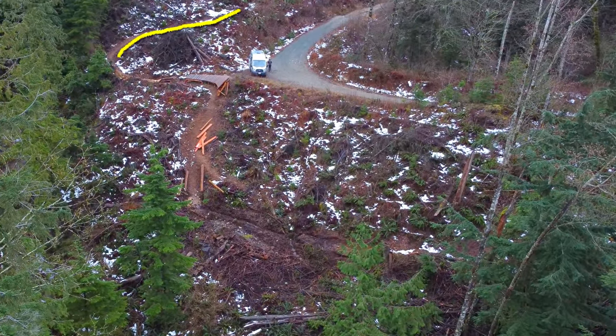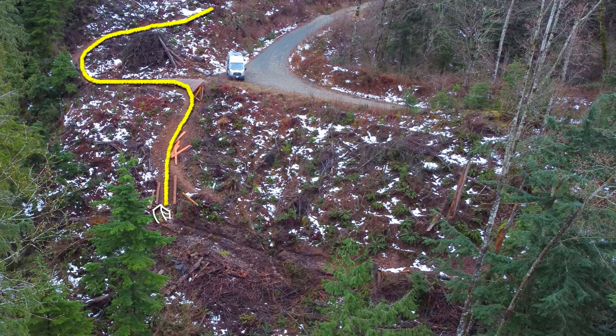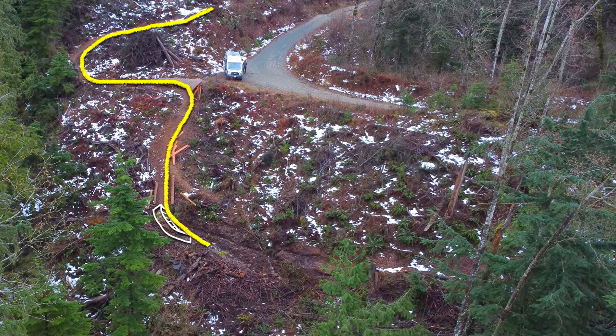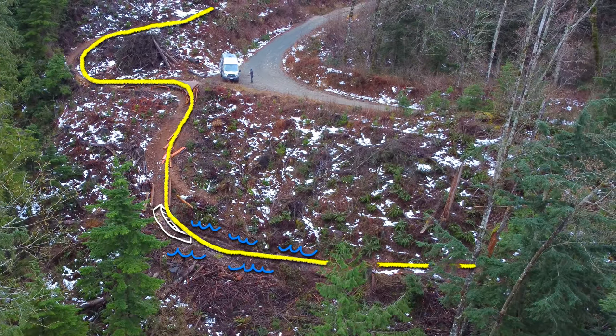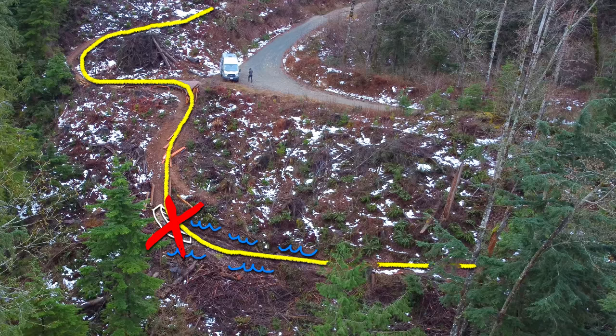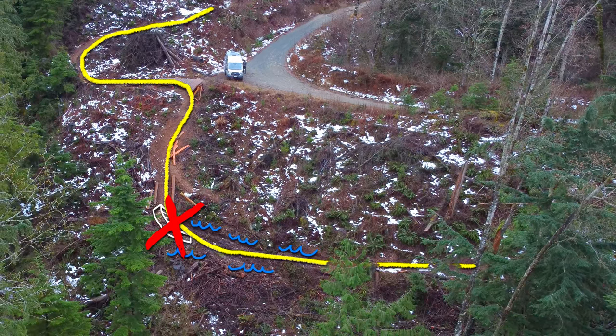In order to preserve the speed coming downhill from the bobsled, we need a berm to redirect the rider left and with enough speed to make it up the hill. Since this area is so wet, digging a big dirt berm here would be out of the question. I needed to come up with something made out of wood.